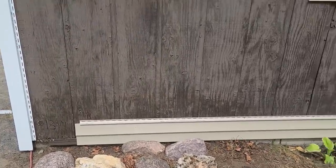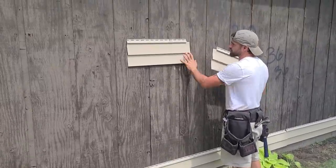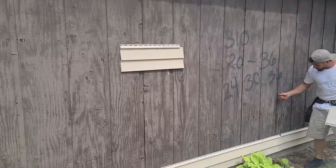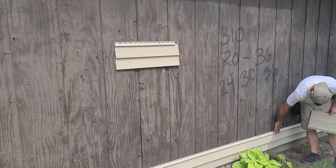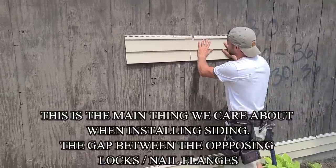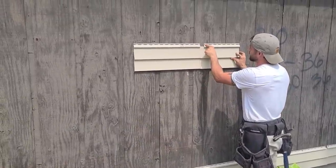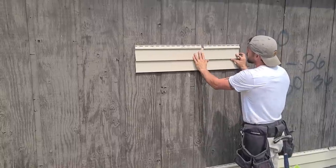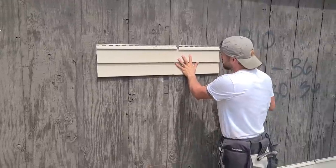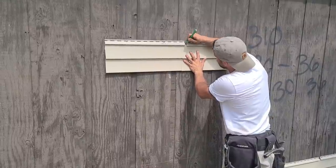All right, so there's probably 5 or 10 different ways that you can get this number. But imagine that I've got 2 full pieces of siding here, just like we had right here. When we put them up, with about a finger's width in between, which is about 3/4 of an inch, right? And they've got room to move, you know, these slots, even if you put it in the center, only allows them to move so much anyway. But this will allow for expansion and contraction, okay? So the way I look at it, you've either got this or you've got this.